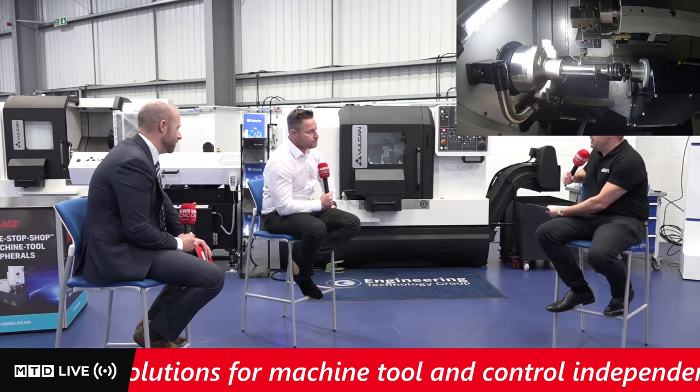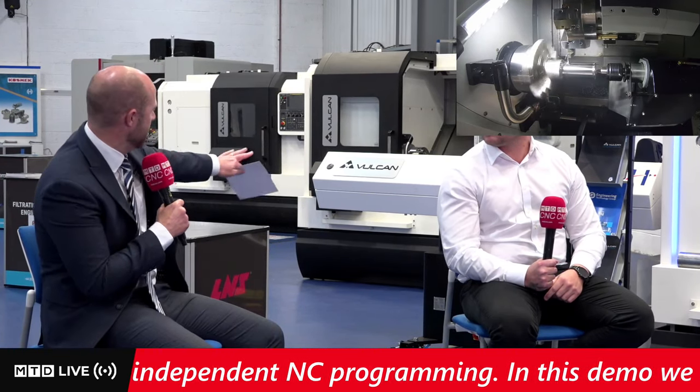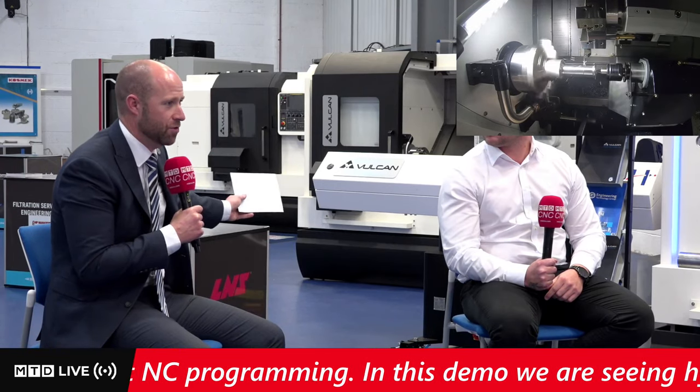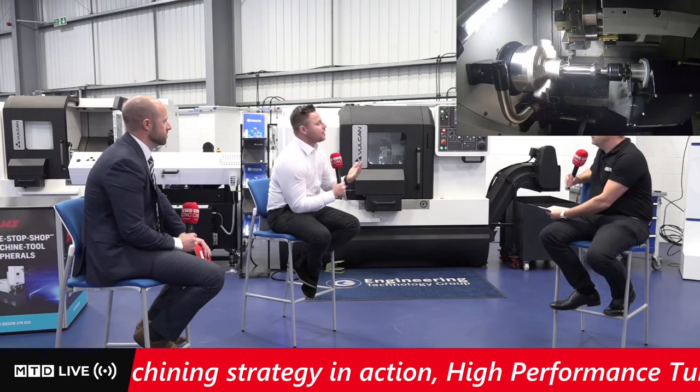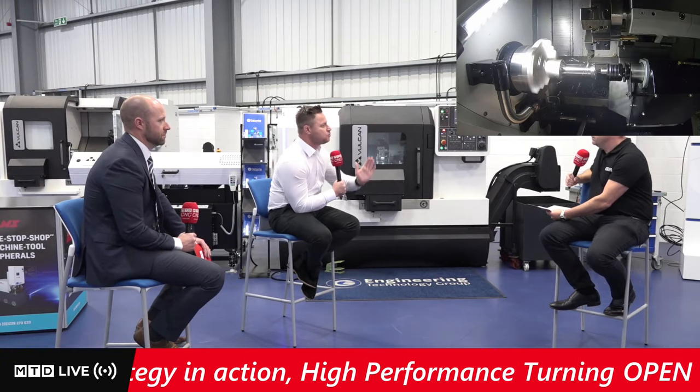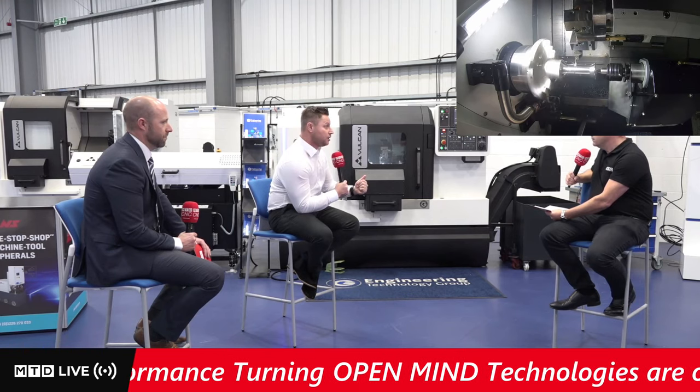Does that mean if you went up to one of the bigger machines you could hit this even harder? This is the entry-level machine, so naturally as you work through the product range — we've got a 250 and a 300 — with bigger spindles, bigger bearings, bigger turrets, and more horsepower. On chip removal, when you use a full radius insert the inclination and engagement is always quite smooth and radial, creating an arc cut into the material so the impact on the insert edge isn't that hard.